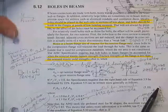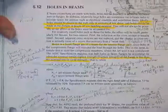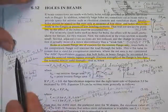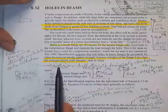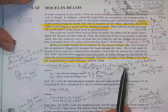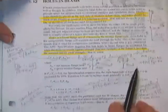However, you do have to consider the holes and drop the strength if the net area under the full F sub U gives a force smaller than what you planned on giving me. Otherwise you can walk on and ignore it. It's a little different from that — if it was that simple, more people would do this for a living. The strength available at F sub U including the holes, if it's smaller than the full strength desired at yield stress without holes, then you will have to reduce the strength.